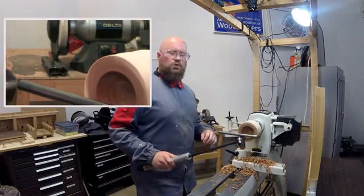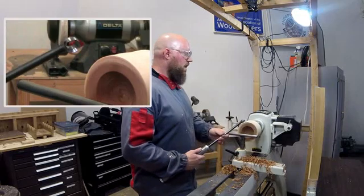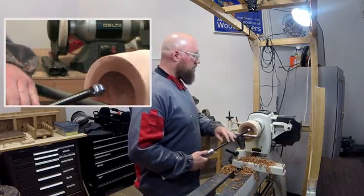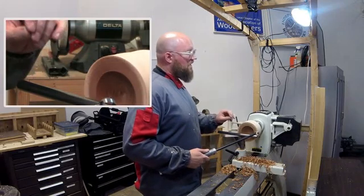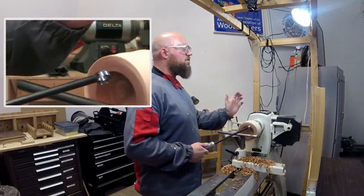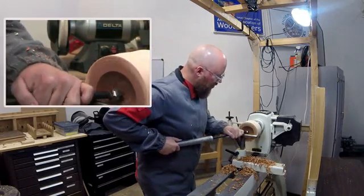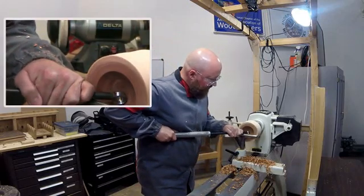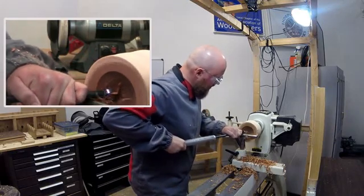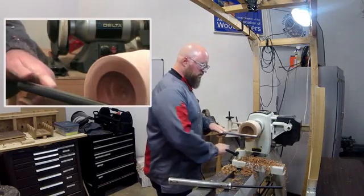So this is the bigger ring tool. The advantage of the bigger ring tool is it actually gets a cleaner cut when you've made a larger opening there to work with. It's actually less aggressive because the angle that's contacting the wood doesn't change as much as on the smaller tool. But they work the same way. Find that bevel. I'm a little close with my tool rest here.